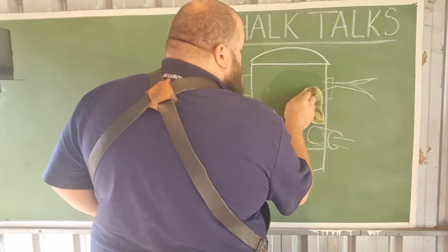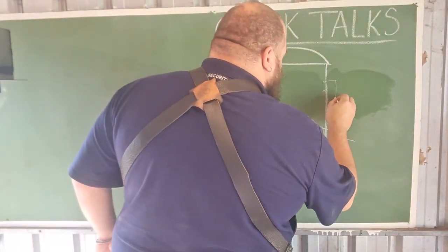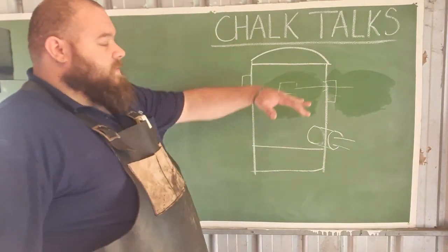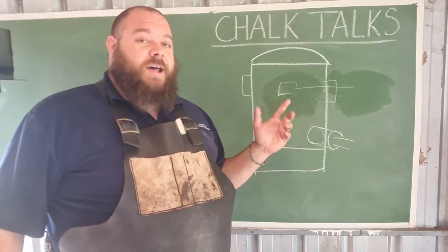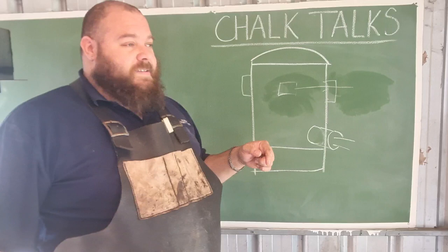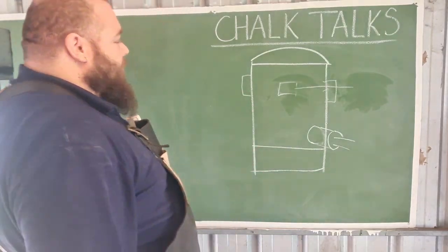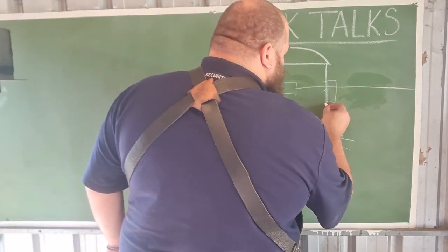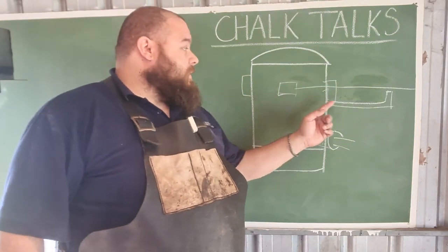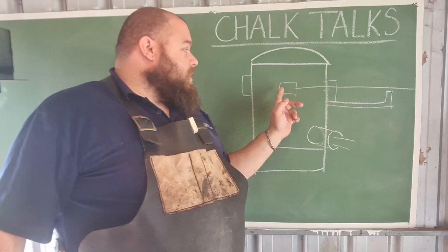I have made hammers using a hammer billet welded onto a piece of rebar as a handle, but that means you have to balance it. The rebar can't just be sitting just outside the door because it'll overbalance and fall into the floor, and when it falls in it's a lot harder to get out. Having a removable lid is incredibly important so you can pull the lid off once it's cooled and fish it out. You need a longer handle, and that's why in my postbox forge you'll see a rail that sits out from the forge door — it supports the handle so the point of balance stays out past that rail to keep the work balanced inside.